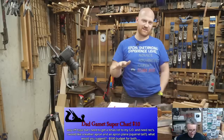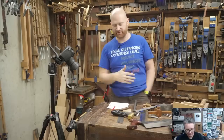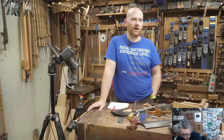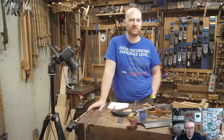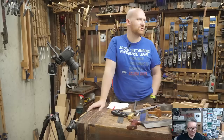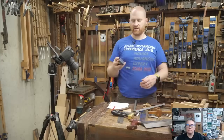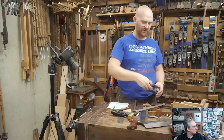For a leather apron, my favorite currently is the one from Katz Moses — really well thought through, especially if you're walking around the shop; it's got all the bells and whistles and a nice pocket for the plane. For a block plane on a $500 budget, I really like the rabbeted block plane from Lie-Nielsen and the one from Veritas — both of those I consider top-notch. I wouldn't go with the squirrel tail — it depends on your hand size. Anything smaller than the 9½ and you're really running into issues.